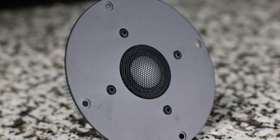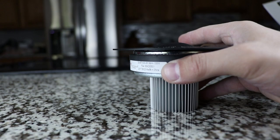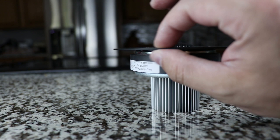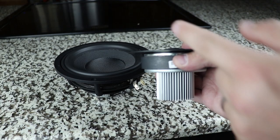The faceplate is over 4.8 inches — that's huge for a tweeter. The good thing is the faceplate is relatively thin, only about 1.5 millimeters or about six hundredths of an inch. That really makes me think you could probably mount this directly on the baffle without having to countersink it. Maybe we'll test that — let me know in the comments if you want me to try that when we do the frequency response testing.